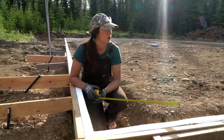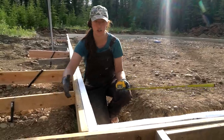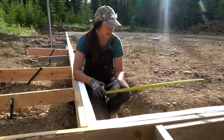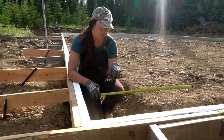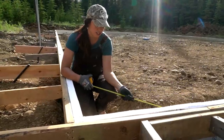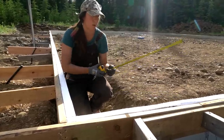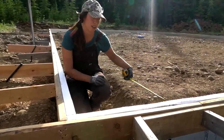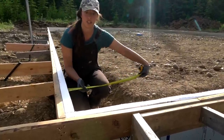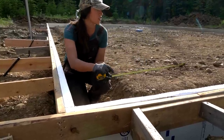We are going to add dirt on the outside of the form so it goes in this little gap we have in some areas, and then we're going to level things off out there. Then we are also going to add just a hair inside. Our measurements, it's a tad deep. We were looking for 18 inches depth on all four corners and walls, and 12 inches width on the end walls, and then 20 inches on this one right here. We're perfect on this side, and a little bit big on this side, and that's just the case because of the bucket.